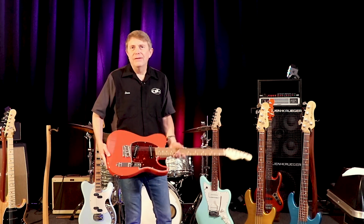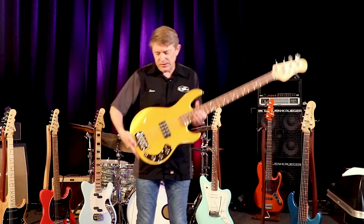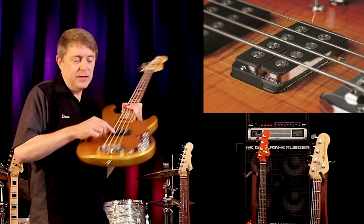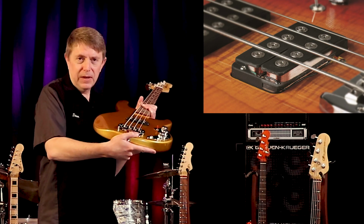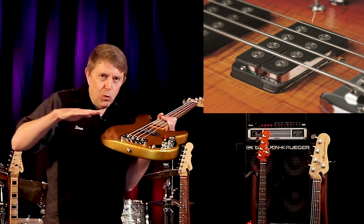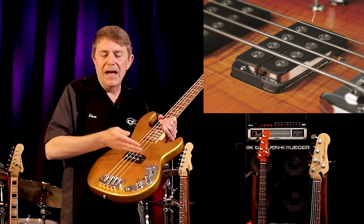It's a unique Leo Fender experience, and a lot of that is due to these magnetic field design pickups. The bass humbuckers, you see again the adjustable pole pieces on them, and I think we've flown in a picture of a cross-section of this bass humbucker. You see the pole pieces, the coil, the keeper plate, and the magnet beneath it. That one bar magnet has everything rated one polarity up, so it just creates this nice, big, broad magnetic field around here.